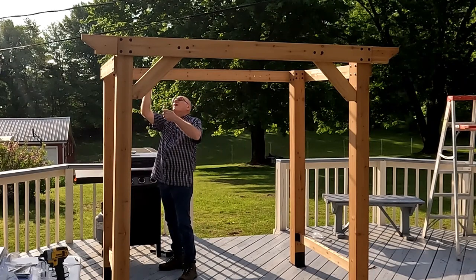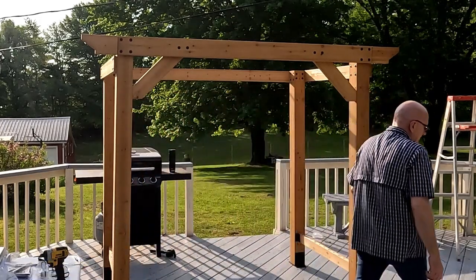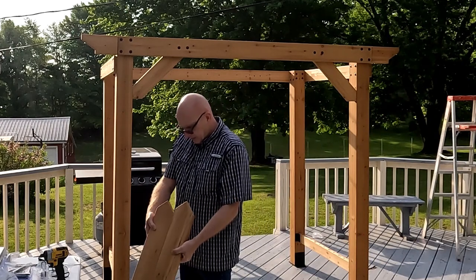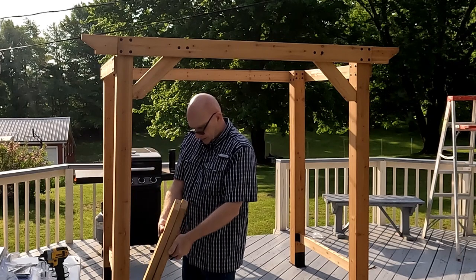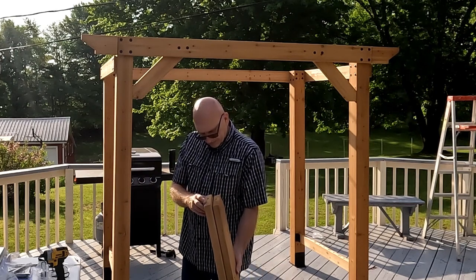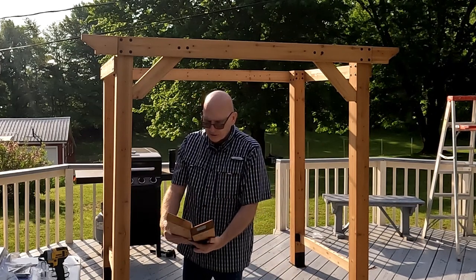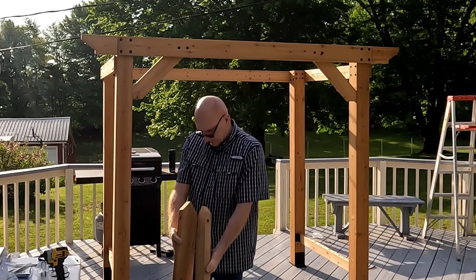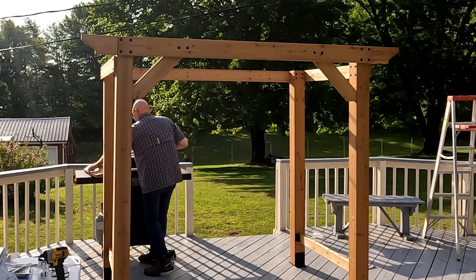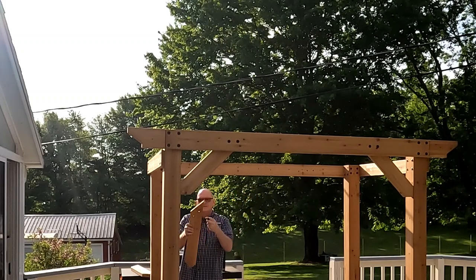7/8 inch, 4 nuts. Back side of the wood here. Get the D5 and the D9. D5 and D9 look identical. I don't know why they called them out separately. But same angles, same pull for the leg bolts. They are not mirror imaged. They are identical. So I'm saying it doesn't matter. We will put one of them here. What does matter is that the hole for the leg bolt faces down.